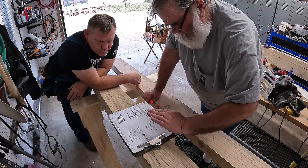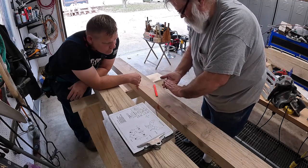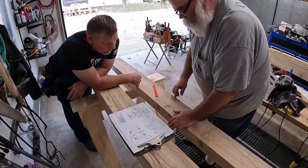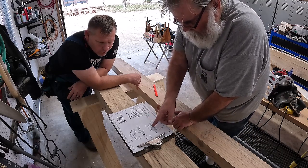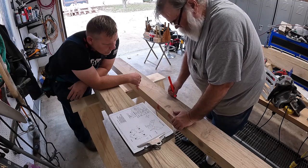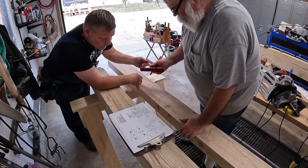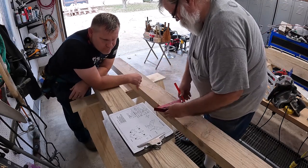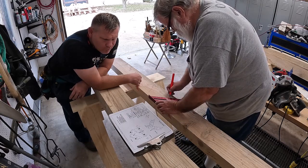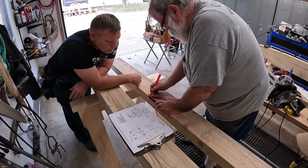So we're looking at this hand. This is this one. The other one's coming in underneath, see? We draw a 45 degree line from this point as a dotted line, triangle. Dotted line. That's the center of the building. This is the ridge.